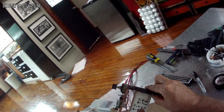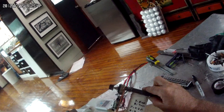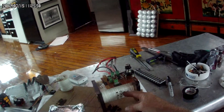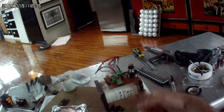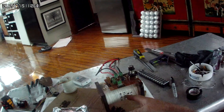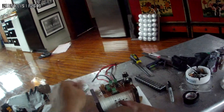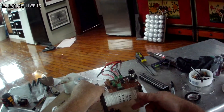The trigger on the top is using .5mm and .7mm wire. I got 4.8 ohms on the trigger and 9.1 ohms on the run. I do believe I'm going to make another coil. I'm going to have the bi-filar — trigger and run together — and I'm only going to put on the 49.5 meters of the .5mm trigger coil. Once that stops, put that off to the side, then continue to wrap the run coil around that.